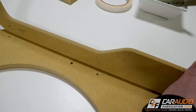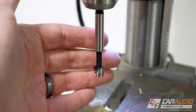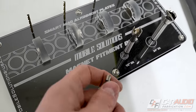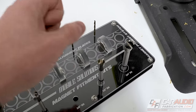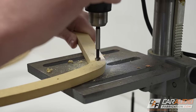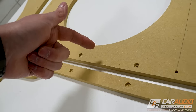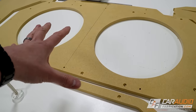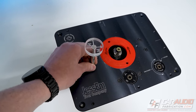I can now pop these panels apart, remove the template tape, and I have perfectly aligned holes on the front and back side of both pieces. Because I'm using 3/8-inch magnets, I've loaded in a specialized 3/8-inch Forstner bit. These are specialty-made bits that are actually undersized ever so slightly — the custom machining allows a really nice tight fitment when you pound the magnets into place. Each magnet is about an eighth-inch thick, so I set up the drill press to go just a little bit deeper than an eighth of an inch, then make each of these holes on the correct side of each piece.